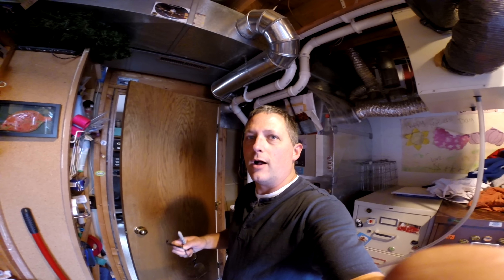Get that checked out. Be safe. Be efficient. Have fun. Change your filter — it'll only take you five minutes. Do it four times a year. It'll only cost you 20 to 30 bucks for the filter, and you are saving money on your heating and air conditioning bill by doing this. It's the responsible thing to do. It's the smart thing to do. Write in the comments if you have any experiences with putting in your furnace filter — or not putting in your furnace filter. What happened if you didn't change it? Tell me your story.